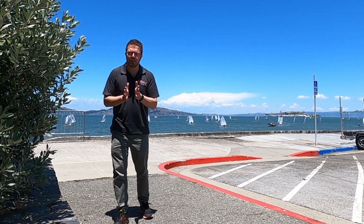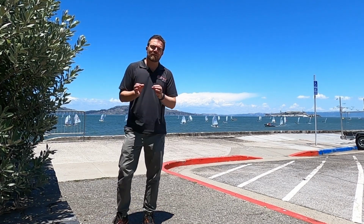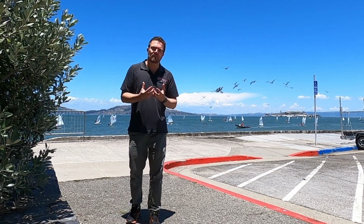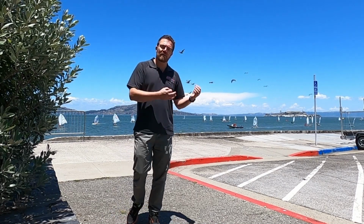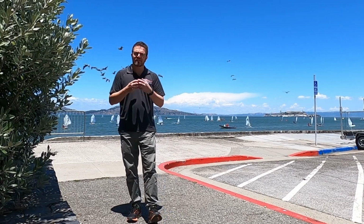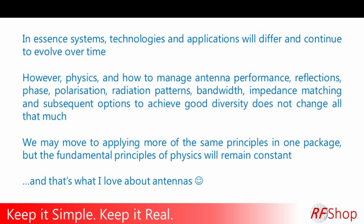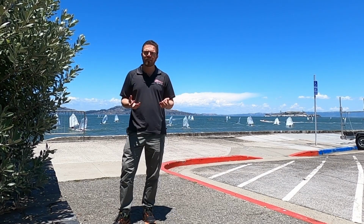Now why would I say that? MIMO means you get two signals into your receiver. I need to know, how can I get a clean signal and a different signal to the radio? That's my biggest focus. That's what I must do, because sometimes it's main and diversity, sometimes it's MIMO, and there's all sorts of techniques that can be used. But if they don't have a good signal, they meaning the software radios, software engineers, then they can't do much with it. So what we basically want to do is get two signals into the radio that are unique, but still from the same source and clean and well behaved.